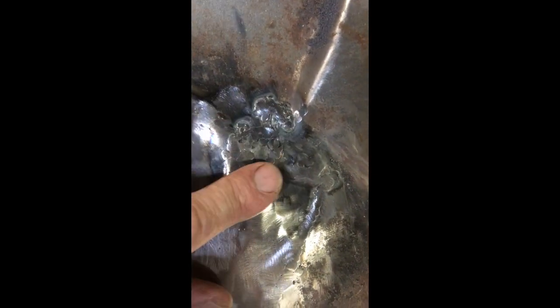That big glob you see — this whole area is just new metal. You grind it down and find a bunch of pinholes, then you have to zap those, and I was burning through again. It looks globby because I had to stack it on top of the old metal, but it's solid — no light coming through. This side was really tough too.